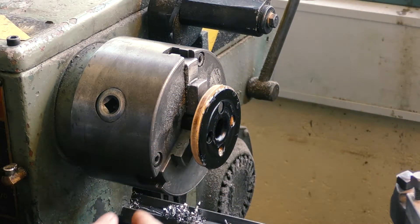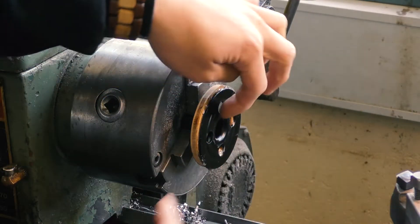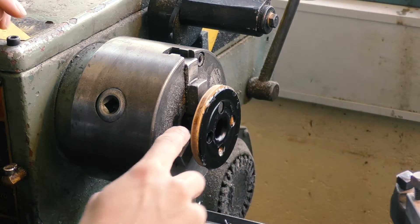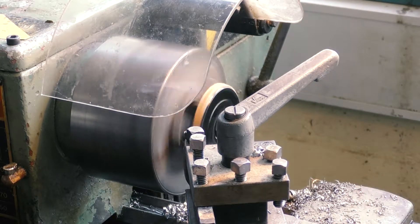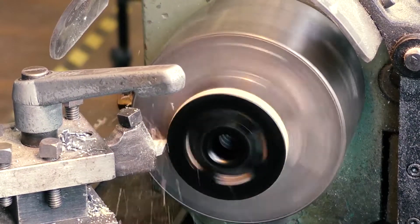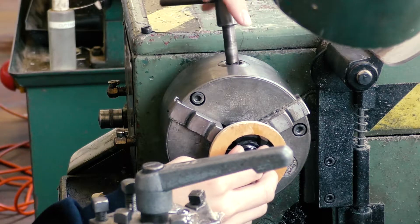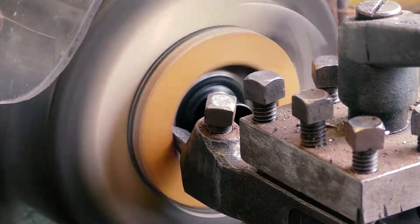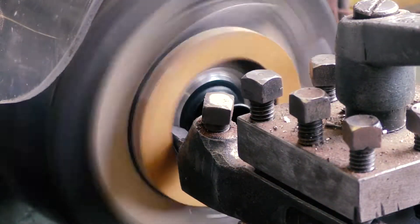The plan of attack is to first make the wood flush with the metal ring, then mount it, take the guts out of the middle, and then reverse-turn it to create an offset in the wood. Parting the middle part off created a very sharp noise because the cutter had a lower surface area in contact. The middle piece broke off and stopped the lathe because the motor isn't powerful enough.